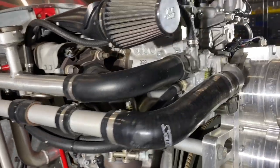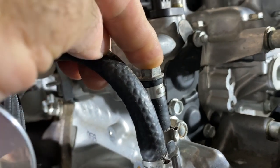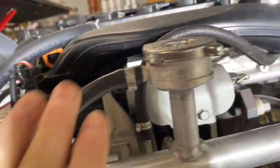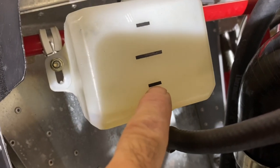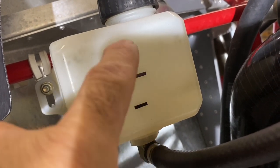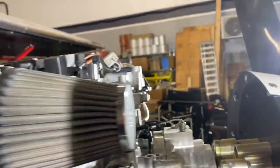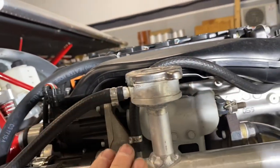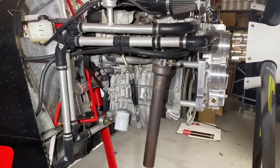There's also a hose here — this one is capped off on older engines, but on later engines it runs to the coolant bottle. You want to make sure the coolant bottle is always full to the first line. During first run-ups, have more coolant in there because every time the engine cools down it will suck coolant back in. That's also why you want the bottle lower on the firewall than the cap — so you can open the cap without coolant from the bottle overflowing. You want the suction bottle lower than the cap.